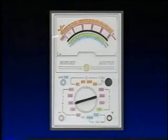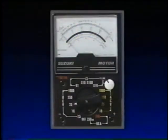The mirror in the center of the meter allows us to see needle reflection. If needle reflection is present in the mirror, you're holding the meter incorrectly and your readings will be wrong. To calibrate the meter, use the calibration screw in the center to align the needle with the 0 on the left side of the scale. Check your meter and make sure it's calibrated correctly.